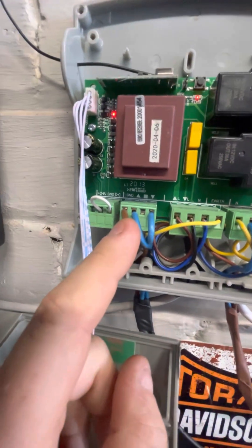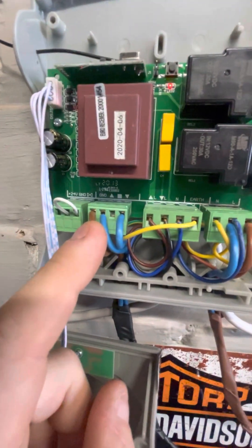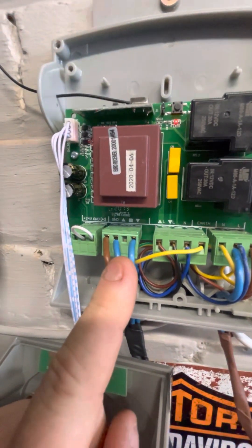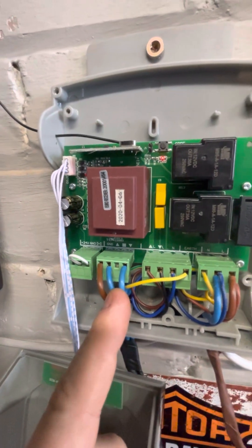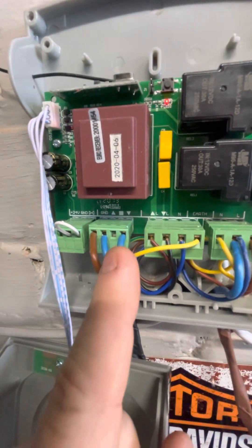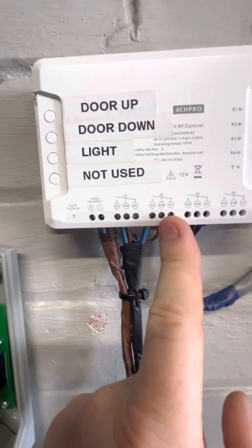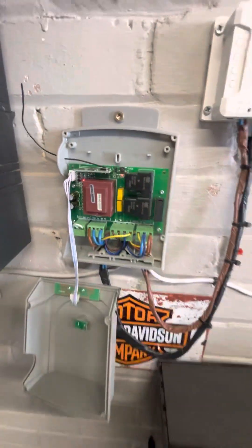The brown wire, which is the common on the 4 Channel Pro, goes to the ground on the block on the left here. The blue wire which is the NO from the 4 Channel Pro goes to up, which is indicated with the little arrow there, and the other blue wire goes to down. Basically it's two controls — this one is doing the door up and this one is doing the door down. So the blue wires go up and down on this block, which will get power to the door.